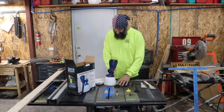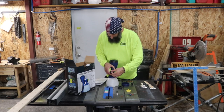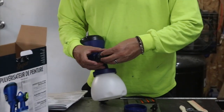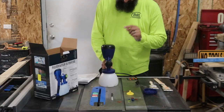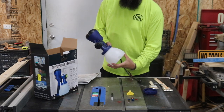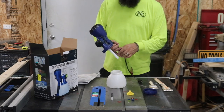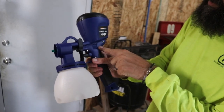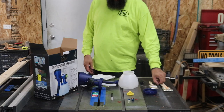So we're going to leave the green one that's on there. We're going to start with the black tip because we need a smaller pattern for our testing, but we're probably going to give them all a shot. We've got the black cap and the green nozzle. We're going to go ahead and put some paint in it and show you the spray pattern. Here's the pickup tube, and on the side there is a knob to change the volume of paint coming out. We're going to leave it as is, put some paint in, and start doing some practice sprays.